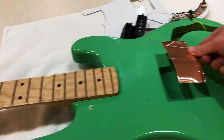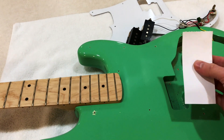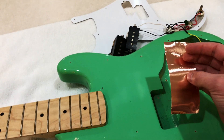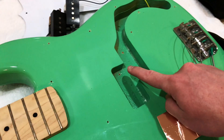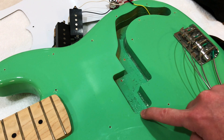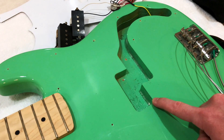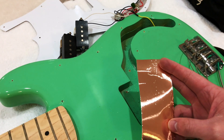I've cut off a section of tape that I'm going to stick in there. The way this copper tape comes is it's got a backing like a sticker that you have to peel off first and stuff it in there. Essentially what we're going to want to do is come up all the way to the lip and just a touch over. None of this will be visible because it's under the pick guard. We want the entire cavity to be completely filled by copper.